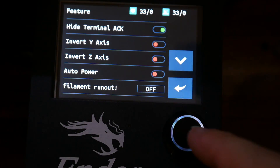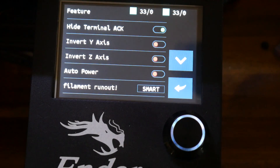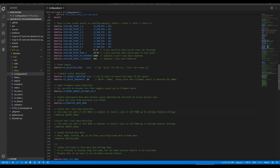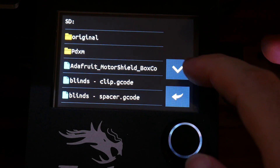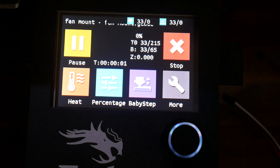After verifying that the LED on your sensor is sensing correctly, come to the TFT menu, then into Settings > Feature and turn on Filament Run Out. If you've got one of the encoder sensors then change it to Smart instead. If you want to adjust the parameters of when the filament is changed that's available in the firmware — by default it will do it 10mm in from the corner. And if your sensor is detecting the reverse of what you expect, simply change Filament Run Out Inverting from true to false or vice versa. Just remember that filament run out detection connected to the TFT will only work when you start a print through the touchscreen mode of the TFT.